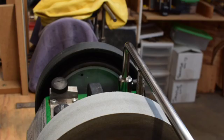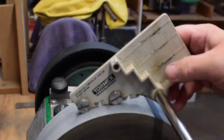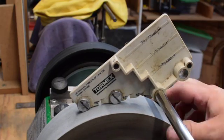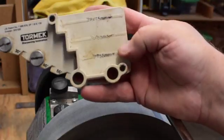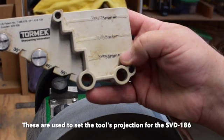The first aspect is how you set the tool up to the right distance. There are two pieces I use, and I found this a really simple technique. This is the TTS-100, which is commonly used for wood turning tools and carving tools. I use the B setting here — you can see the two marks confirming the distance is set correctly for the B hole. The standard settings that came with it are 75, 65, and 55 millimeters, which works well for turning tools but doesn't translate well for chisels.